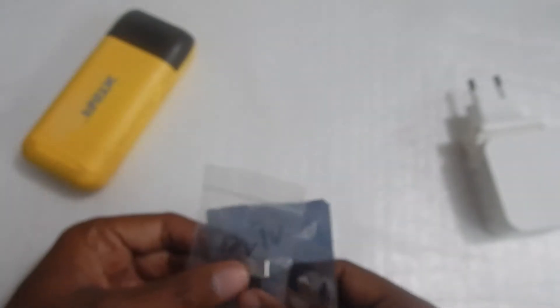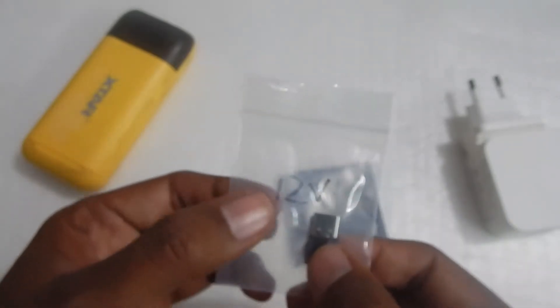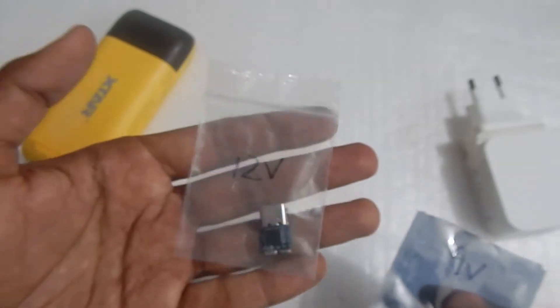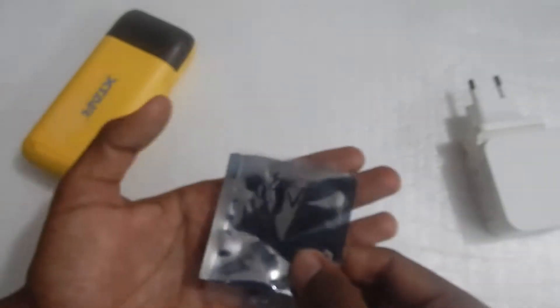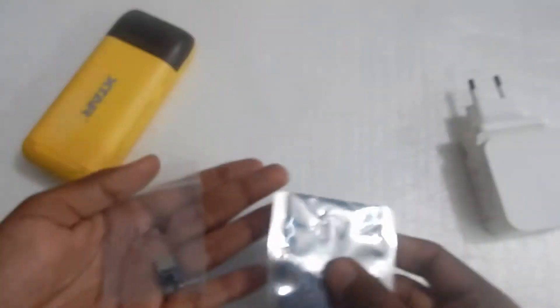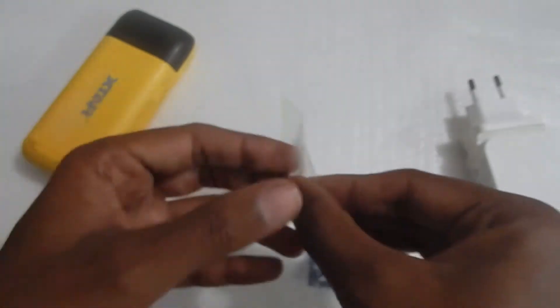These triggers are available in two variants. I've got two here which are the 9V/12V version. The other variant is the 15V and 20V version. You can convert a 12V into a 9V or a 9V into a 12V. If you want 15V and 20V, you will have to buy another module, which is capable of converting from 15V to 20V and 20V to 15V respectively.